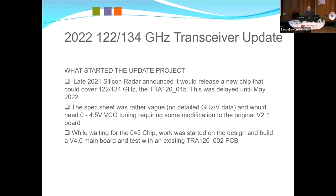So we used to round the frequency, and that worked okay for JT4, but it actually is technically capable of locking on frequency within 1 hertz. At 122, you can do the math on that. That's better than what we need, but certainly you could use it as a digital transceiver if you really wanted to do the firmware. The good bit was the test now, the phase noise close in was nearly 50 dB down in the first skirts.